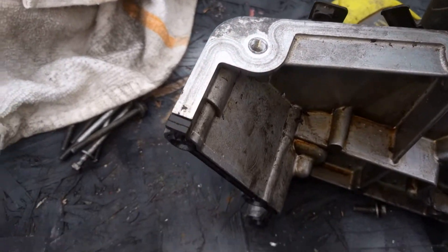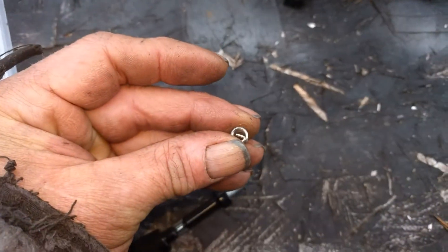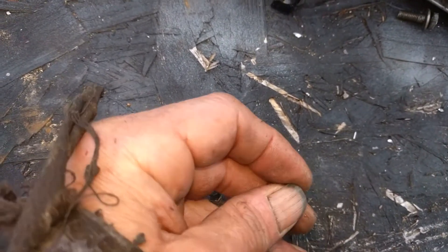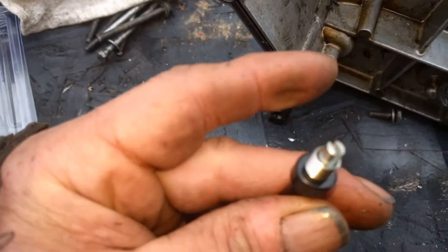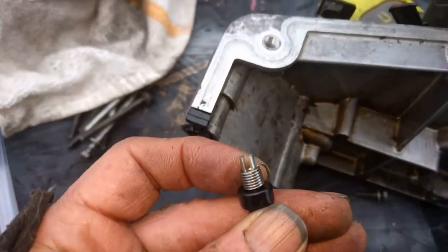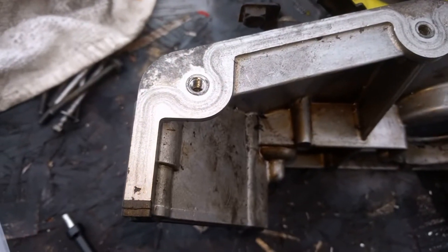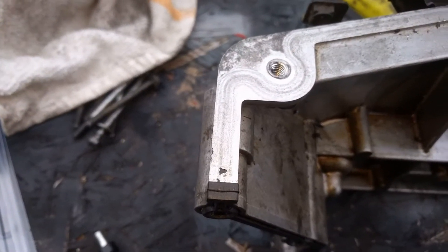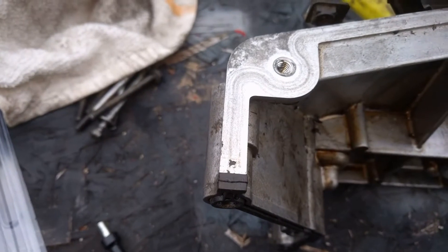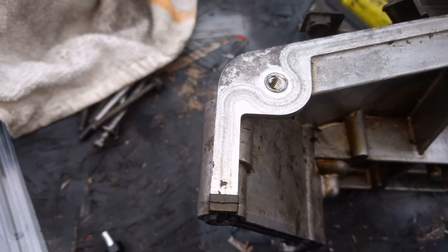The last thing is we've got this tool and these inserts. You can see the insert has a tang on it and the tool has a slot in it, so you just slide the insert over the tool so it sits down in the slot. Then you turn it in. The insert screws in pretty easy. Take note: make sure the first time you drill it deep enough so you can run it in flush, because you can't get them back out — they're designed to stay in. Whenever you loosen the screw up, they won't come out.